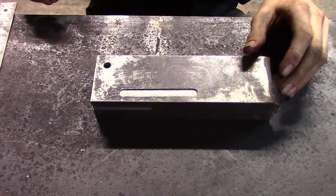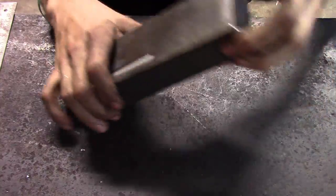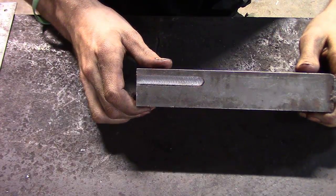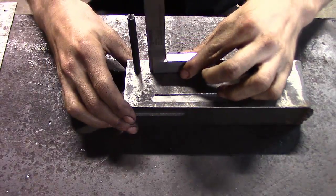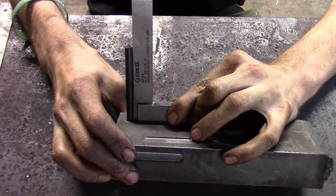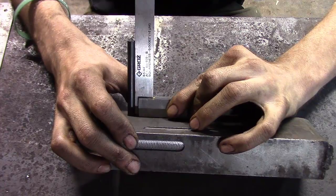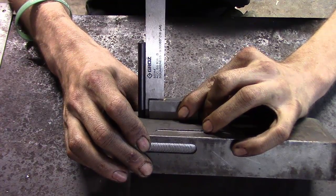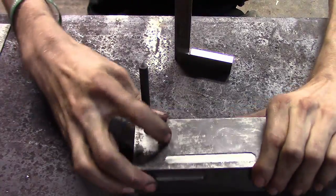Let's take a look at our handiwork and see how we did. You probably noticed right off the bat this piece is crooked — it is, probably 30 thou out. The reason was I didn't realize there was a tack weld on the end that pushed it off the vise. I recut one on the other side and nothing changed. Let me show you how well it turned out. I've got a center punch pin here and a machine square. There's a little deviation towards the bottom — I think there was a chip under there — but that is pretty slick. Much more precise than you can do with a drill press, and this is a deep hole in inch-and-a-half thick material.